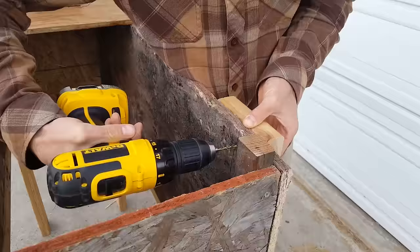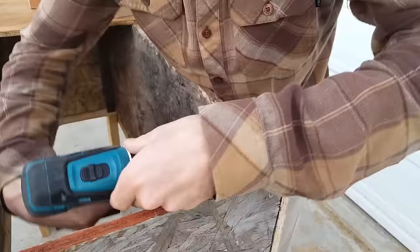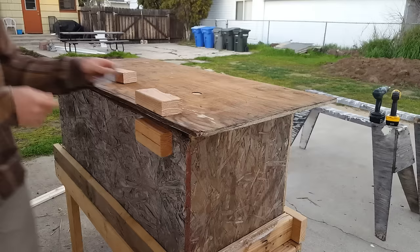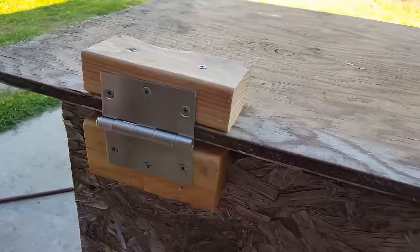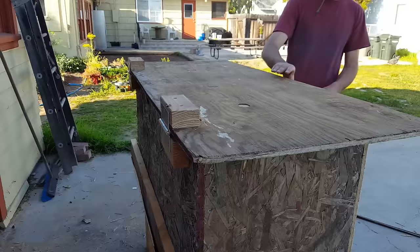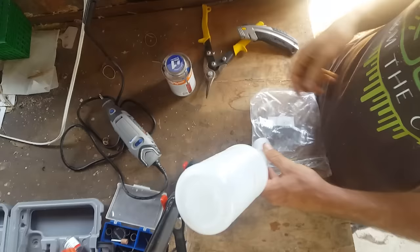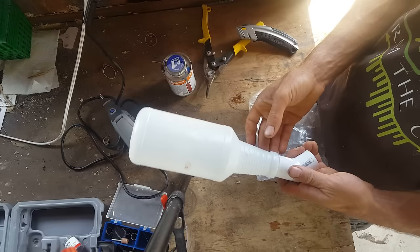Now I'm going to be attaching the supports, which are going to attach to the hinges, and then the box and the lid. For the supports, I'm using a piece of 2x3 and 2-inch number 2 screws. I'm going to line up the support boards — the hinge will rest right in the center. Now I have a nice lid. The first thing I need to do is actually build the collection bucket where the soldier fly are going to dump into with the ramp. The height I make this is going to help me determine where I drill the hole in the box.